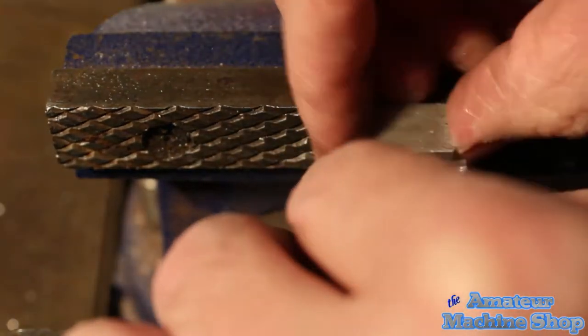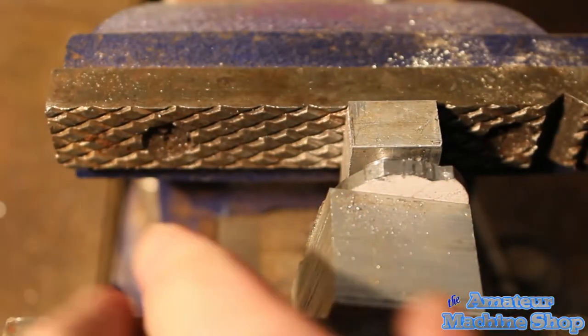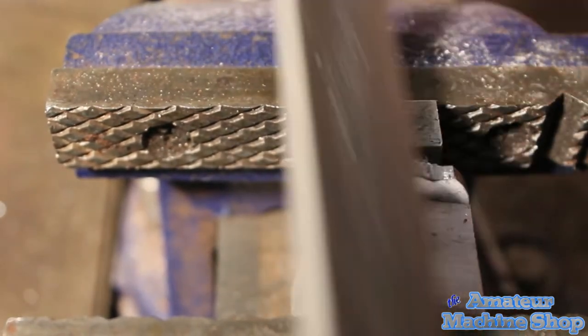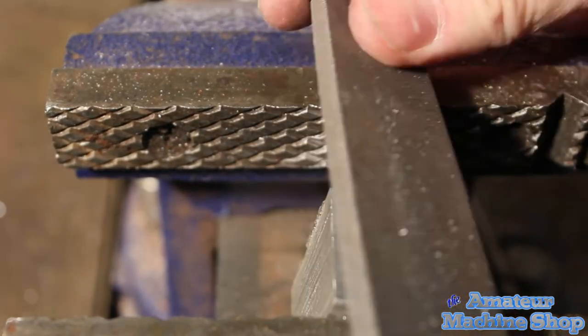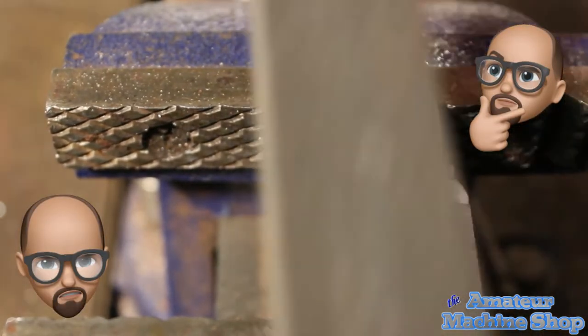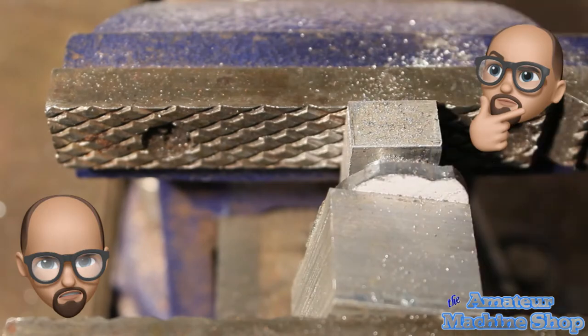With the cam disc lobe area roughed out, the next step was to bring it closer to the profile and smooth the surfaces. I started filing, but it was hard to control the depth of the filing, hold the file straight, and ensure the filing would follow the profile of the part. Spending some time thinking, I remembered previously having seen how this could be done.